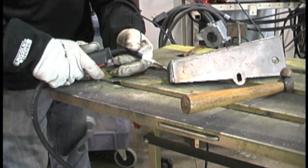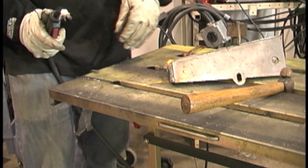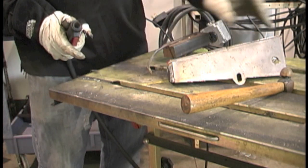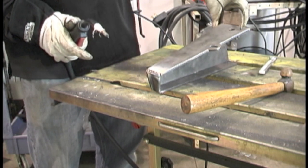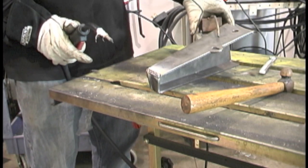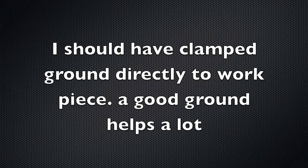When going even a little uphill, I prefer to weld uphill — I'd rather that puddle not chase me down, and I want a little more penetration, especially using a small MIG welder. I've got Teflon tape around the threads of the tip to protect them, because this thing has a capacitor charge built up and will arc out and screw up the threads if you lay it down. You don't need a nozzle with flux core, but a special flux core nozzle that keeps you from grounding out is good to have.